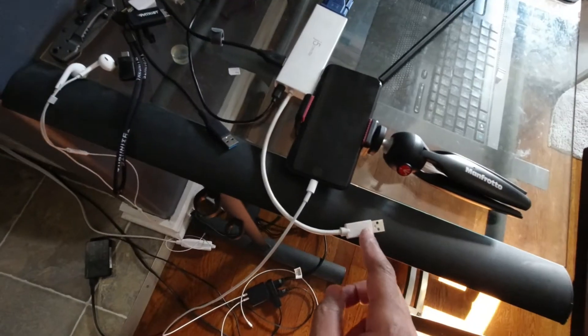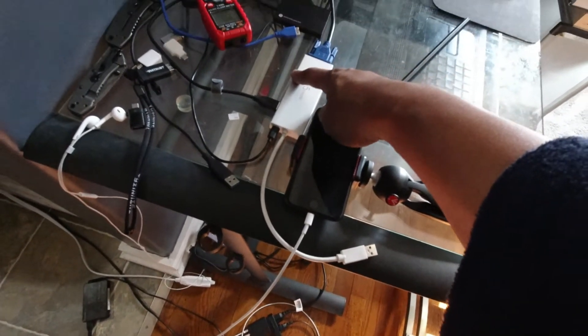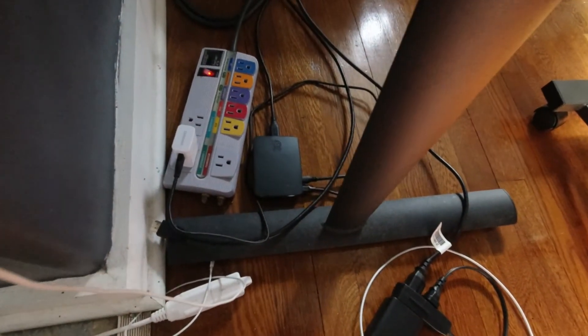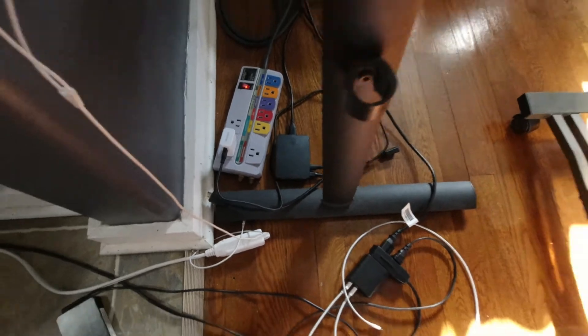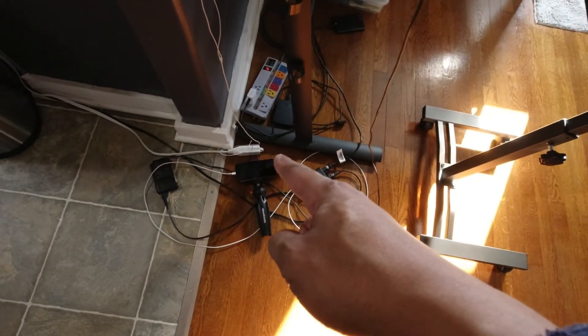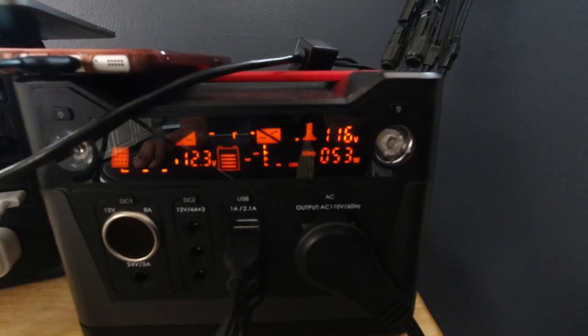We go from here to here and this laptop is gonna go up here, plugged into this USB 3 to VGA. It has HDMI on it too, but I use that with my Raspberry Pi, which I never really plug into solar — it only uses about 5 watts and power fluctuates. The Raspberry Pi needs a stable operating system running. So right now we have the laptop, the monitor, and the iPhone, which is probably pulling about 18 watts on that USB-C to Lightning port — about 55 watts total.